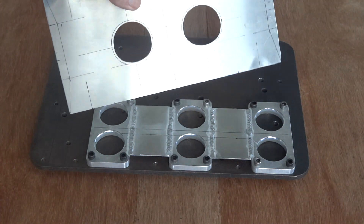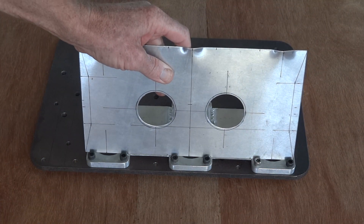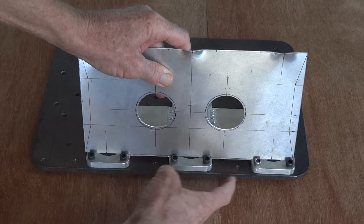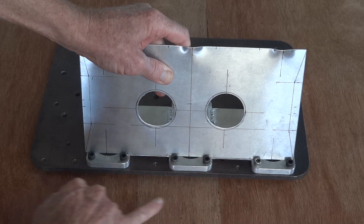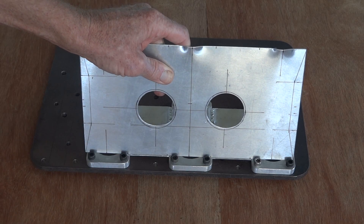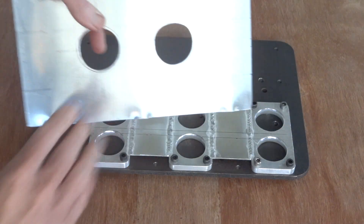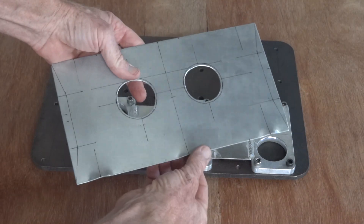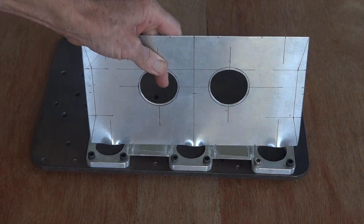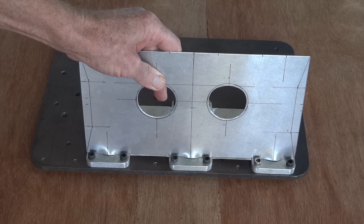Now if you look carefully at that, I can't make the base any wider or else we won't be able to get the bolts in, but that leaves a little gap here which doesn't work. To deal with that, I've made a little flare — a little crimp, a little stretch, a little lump in the plate — so it lines up like so.